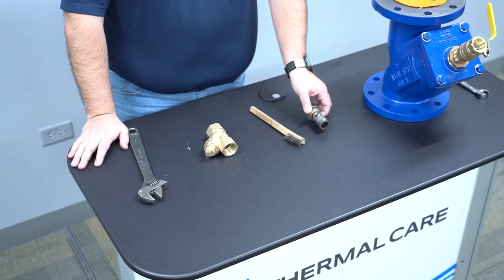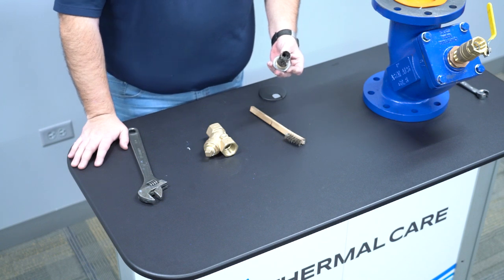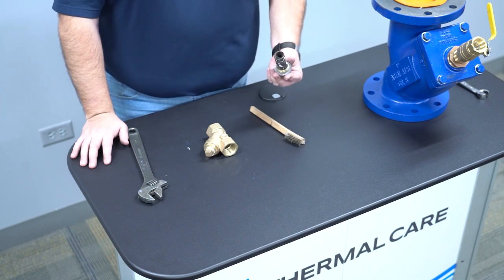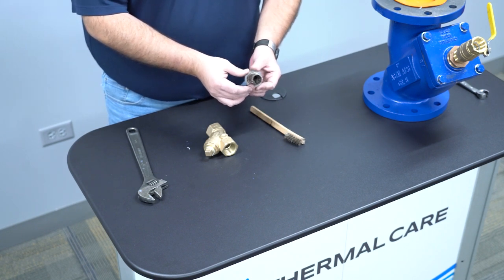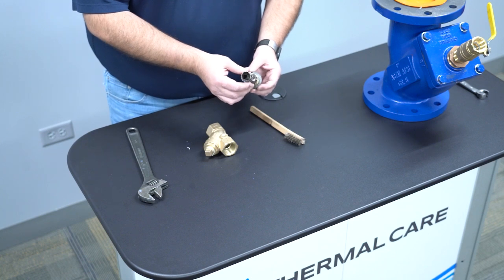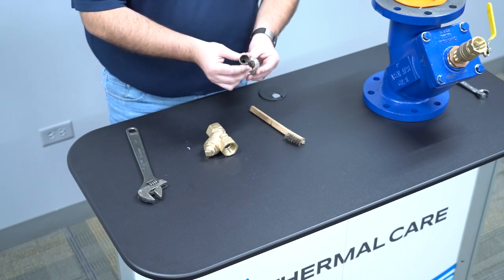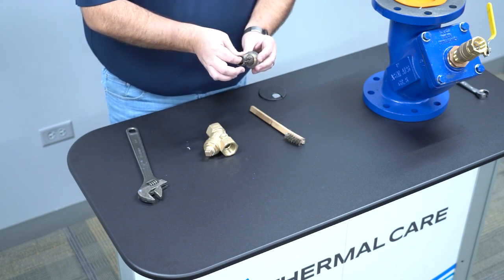I have an example of a poorly maintained chiller system in the field. A customer called me explaining the issues they were seeing just like I was explaining to you. I asked them to pull the strainer, and we found that the system was so clogged with dirt and debris that we were no longer able to get any water movement through the system. At that point, there is no going back — once it's as clogged as it is, the entire strainer must be replaced. We were not able to get any of the debris out of it. It was solid.